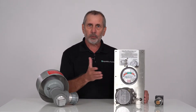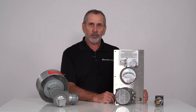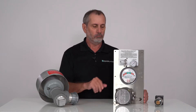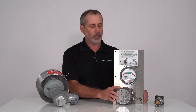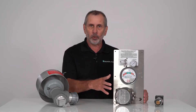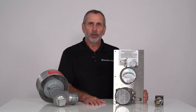So what are the differences between a WPS and a WPSA? As far as mounting and the vents that are used with it, they are identical — there's no difference. The WPS and the WPSA physically look the same and they mount the same. The flows and the pressures for operation and purging are exactly the same.